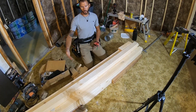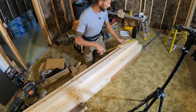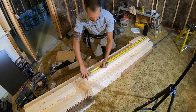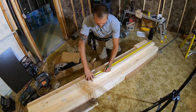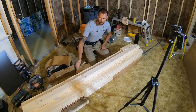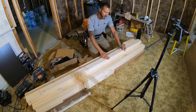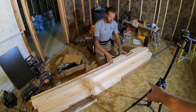I like to lay out windows and doors first. So if I'm laying out this wall and I know I'm in my opening, anything in layout — say at 48 — I'm still going to mark my layout but I'm going to mark a C so I know that's a cripple. Anything through the opening will be a cripple.